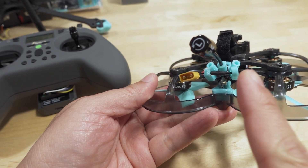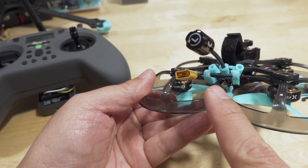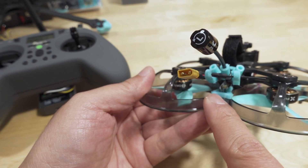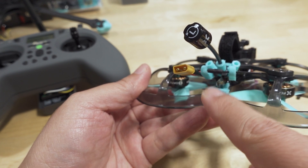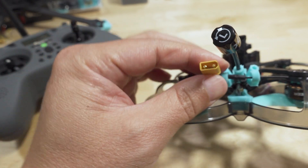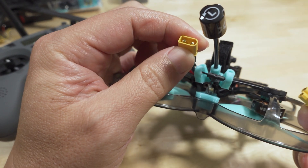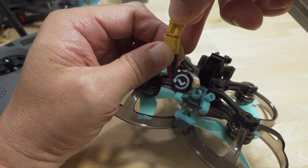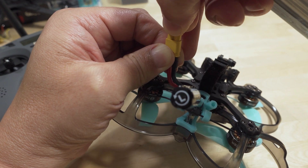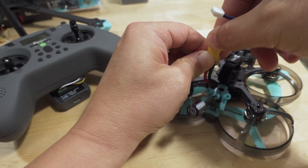This is the thing that gets people — this is what they want to see. You have to power the receiver on, the light turns on and off, then unpower it. Do that three times. The third time, the light will double-blink, and that means you're in bind mode. Leave the power plugged in and it will continue to double-blink. At that point you're ready to go to the transmitter to execute the bind command. I'll show you now — watch the light.